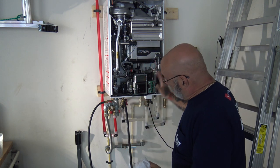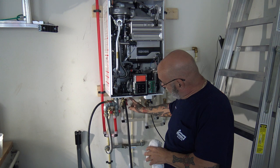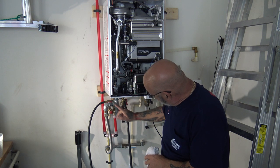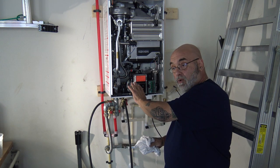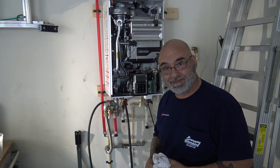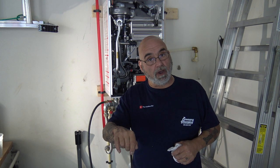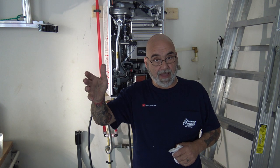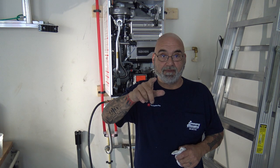When done, unplug it, take off the two hoses nice and neat, put the caps back on, shut off the valves on the recirc and the hot, then turn the water back on, flush it all out, turn the system back on, and reset all your parameters if you have to — and they're back in hot water. My email will be in the description below if you have a question; feel free to email me and I'll get back to you. You all be safe now and I'll see you on the next video — bye bye.